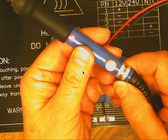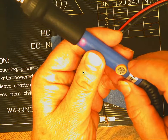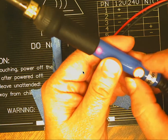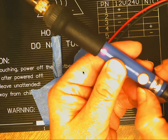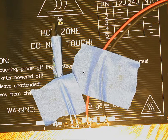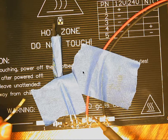And so in the lab, we'll have some soldering irons that are taped over, and we don't want you to take the tape off to change the temperature setting, but we have some that are hotter ones that have the dial on here. So if there's one with the tape off, that's one that you can increase the heat to the maximum so that you can get more heat onto the heated bed, because the aluminum seems to sink off a lot of the heat and it's really hard to get it heated up.